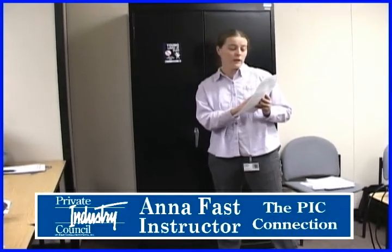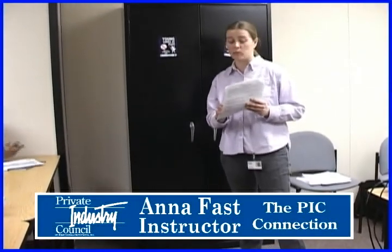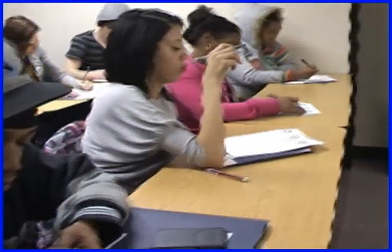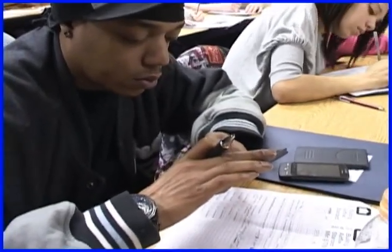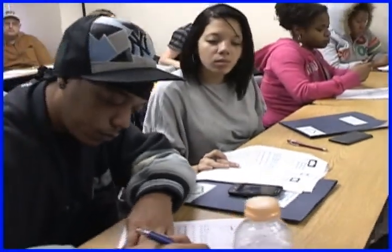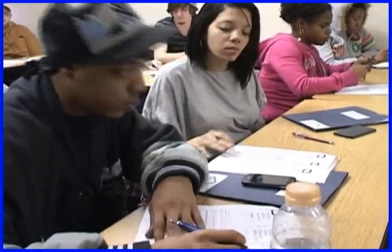So that's the one we put in the first, and then we space that on the third line. The higher airflow required is the 49.28 cubic feet per minute. Multiply that by the N factor, which we said was 16.2. That gives us 798.336. And then the next one just says blower door reading, which is already in the third block.